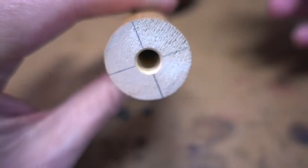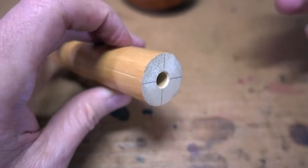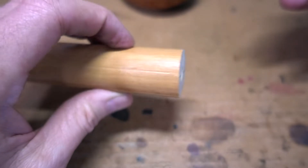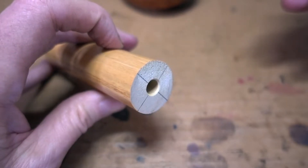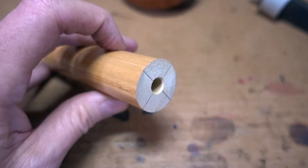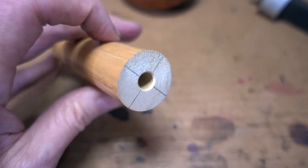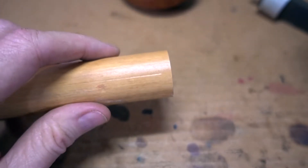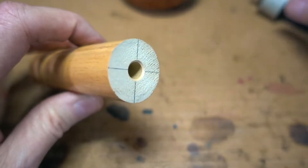So you make a fake pipe — nothing more than a piece of wooden dowel rod. You can get dowel at hardware stores, but typically it's oak and it's splintery, fairly expensive, and a beast to work with. I've had much better luck getting replacement broom handles for push brooms at a full-spectrum hardware store — not a little neighborhood one, but one that might have commercial accounts. Those commercial custodial outfits don't use plastic tube brooms; they want old-school stuff. They sell replacement handles for mops and brooms — I don't know if it's basswood or what, but it's a lot softer than oak and plenty hard enough.